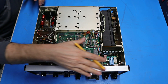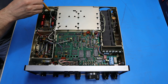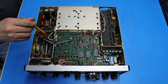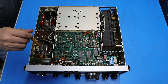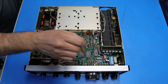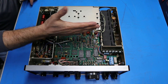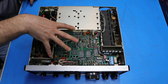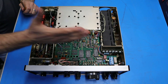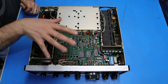I've got the radio oriented so the top front is here and the back with the antenna connector is here. Starting at the back, this is the low pass filter output board, the antenna changeover relay, and the low pass filter input board. This is the high pass filter assembly, and this of course is the main speaker. This large horizontally-mounted board is the display driver board with all the display driver and logic chips. Underneath it there are several vertical boards plugged into a motherboard at the bottom. This board is very difficult to remove, so I'll flip the radio over later so we can see the bottom of what Drake calls the parent board.